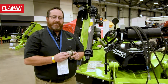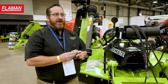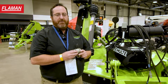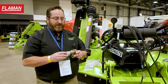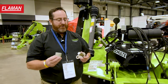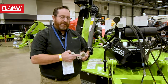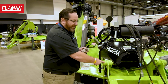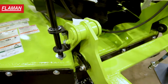One of the changes on this machine is we've reduced the amount of grease points. With the hinge points on the hitch and on the wheel standards, we've incorporated a fiber wound bushing into all the pin locations, so there is no greasing of these pins. They have a fiber wound bushing and a bigger diameter pin — now at one and a quarter inch as opposed to a one-inch pin — for long life and durability. This is the area where you'd see that beefed-up bushing, and inside is the fiber wound bushing where the pin goes in.